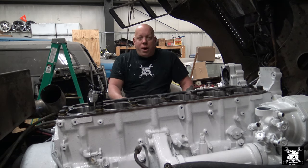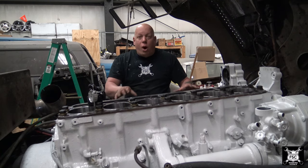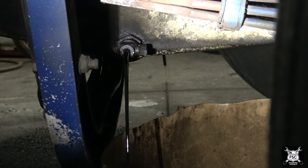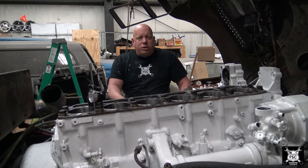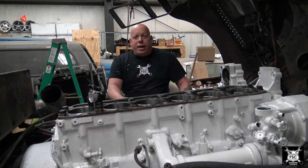Now with that being said, upon arriving back to Wisconsin, I had to find out what happened here. When I dumped the oil pan, I found out there wasn't a water puddle on the bottom of the oil. I'm not a science major here, and far as I know, water and oil, they don't mix. I don't know if it's a proper use of the word, but my father would say that his father, with either a Model A or a Model T back in the day, dealt with something similar, and he said it was like the water and oil would homogenize. The oil that came out of this engine was thin, but there was no water and oil separation in the oil pan. Either way, obviously the water was going into the crankcase, there's no debate about that.